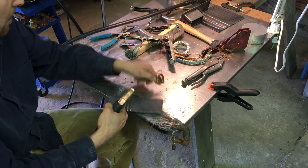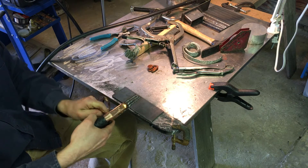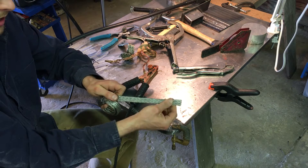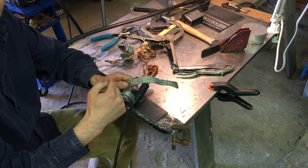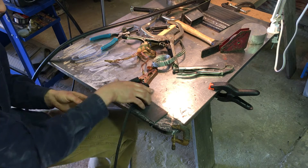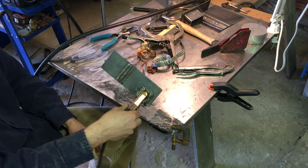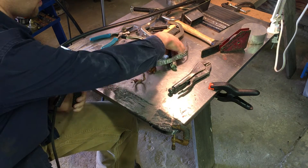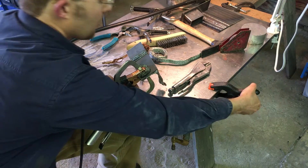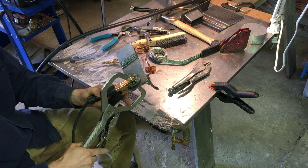You can do the same thing with flexible stranded wire — bend it over itself and clamp onto that. Or you can use an automotive bonding strap, basically used for grounding an engine to the car frame. Wrap a piece of that around the top and bottom of your metal, put it in the jaws of the alligator clip, and clamp on. You can also add clamping pressure using vise grips, a clamp, or even a plastic spring clamp to get a really tight bite onto the base metal.